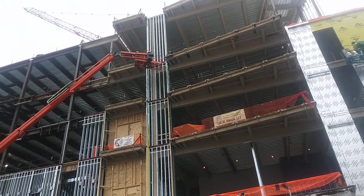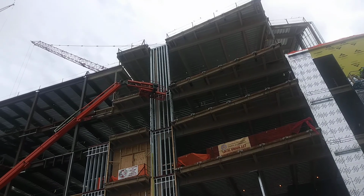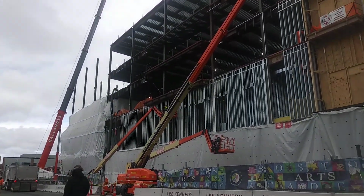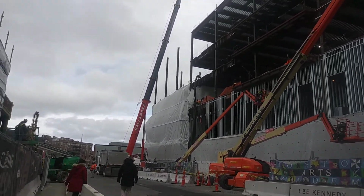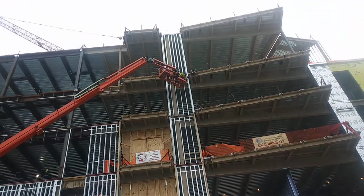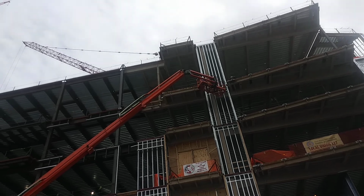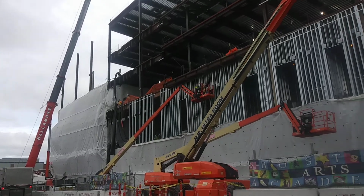I don't recommend being on them at an angle like that. The further you stretch the boom out at an angle, it's like a fulcrum over here, and that's not good. I've seen those things rock where the wheels are coming off the ground. I just don't like it myself. He's not fully extended, but he's almost at a 45 degree angle, which is not too bad. But like I said, I just don't like the way they wobble like that in the air.